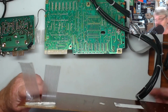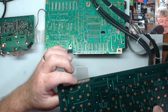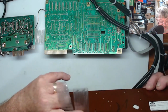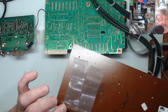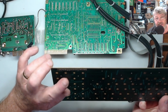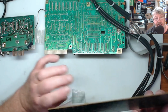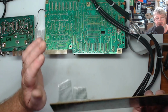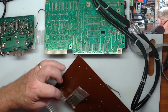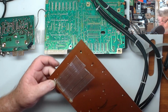Okay, so as you can see on here, the cable's generally in two parts. So I'll desolder one part of the cable, then on the back here you will find there's the glue. Pick off all the glue, and then I'd work one cable out. If any of them are still slightly catching, I'll desolder those or heat those up with the iron and pop those out, and I'll take that half out. It's just easier than trying to do the whole thing at once and tearing a pad or something like that. So the other thing that can happen with these is the glue, like this has been done differently. This is a softer glue.